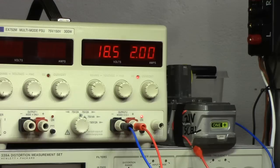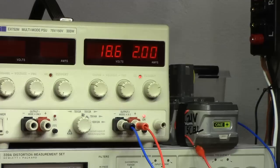So there you go — one Ryobi OnePlus charged without a Ryobi charger. Now keep in mind there are no protection circuits or anything on this, so if you want to do this modification you do so at your own risk. If you don't use a properly regulated power supply you risk exploding your battery, because it cannot disable a dodgy charger. Just keep that in mind — cheerio!